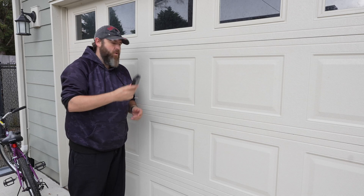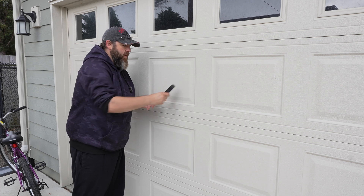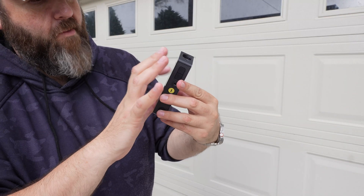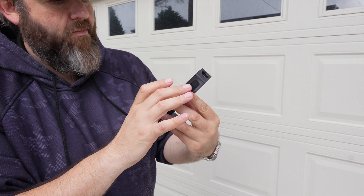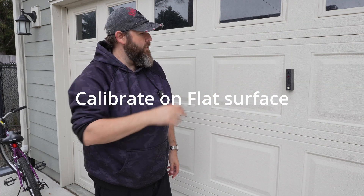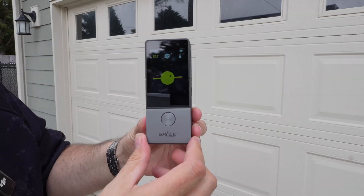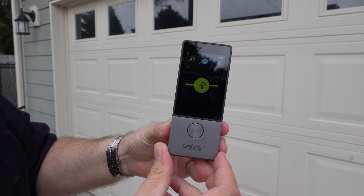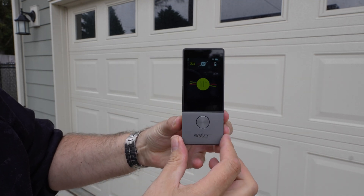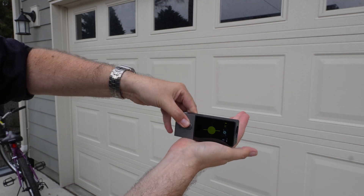I brought it outside to show you sticking it to metal — you can use this for construction or to line things up. I forgot to mention it does have lasers. If you go to the live angle display, it self-calibrates — you put it down flat and leave it alone for a few seconds while it counts down. You don't want to hold it or it will fail. Once calibrated, you have a digital level using those lasers, making it really easy to level things.